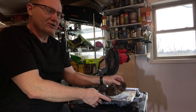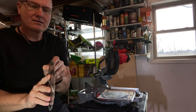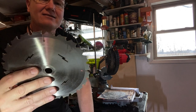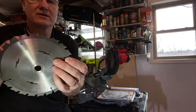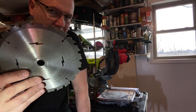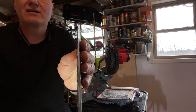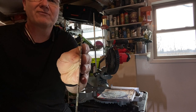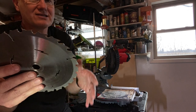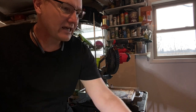Now, if I want a finer cut — like what I'm going to be doing with the project where I'm building face plates for that shower stall — I'm going to want a blade that has a little bit better, more finished look. This particular one is a finished blade. So we'll count: it's a 24-tooth, but it is designed just a little bit differently, so it's going to give you a slower cut. It's not going to be quite as aggressive. We can see that there's a little left-to-right tip on the teeth, a little bit narrower kerf. It's carbide-tipped. So this gives us a slower cut, but it's more suited for plywood-type material and would work for what I'm trying to do.